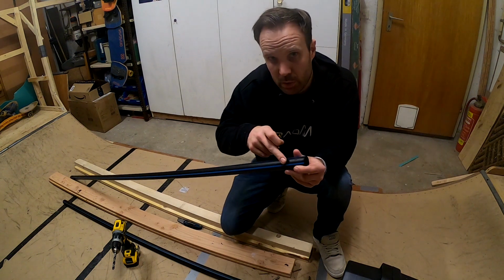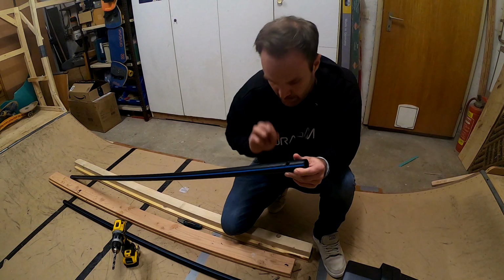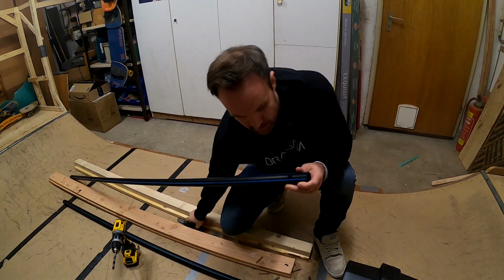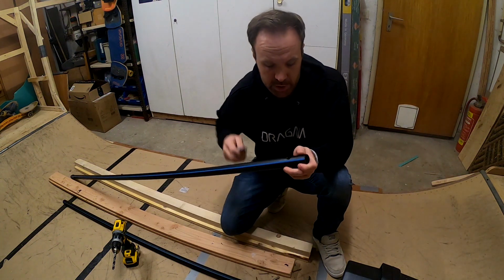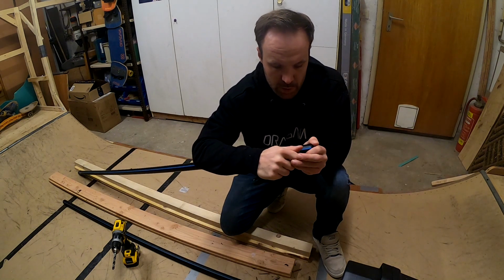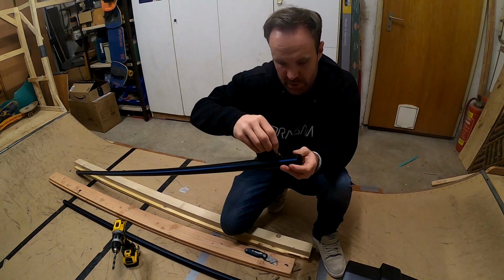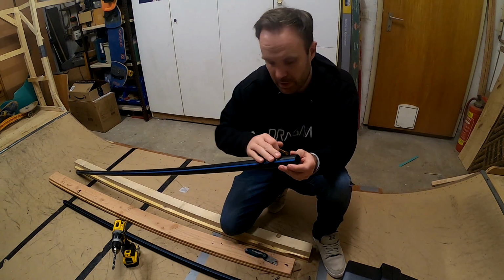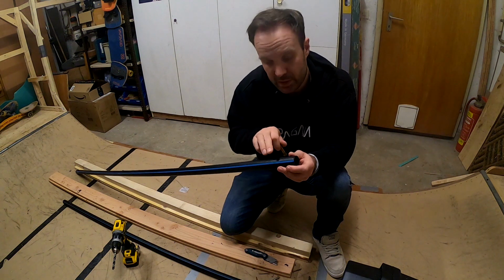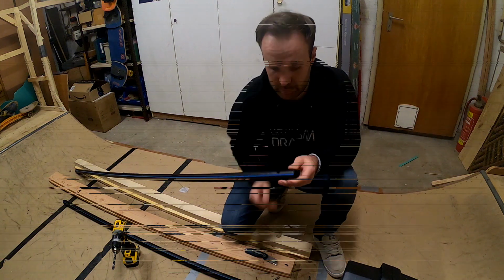After drilling the holes in the pipe, make sure the heads of the screws will go in easy. Second thing you have to do is remove the burrs here from the drill hole, otherwise you might get stuck when grinding. You can do that with a knife, or if you have one, just use a countersink, give it a small drill and it's good to go. It's important that this is a very plain surface, otherwise you will have problems grinding.